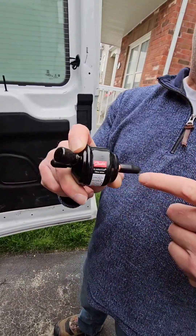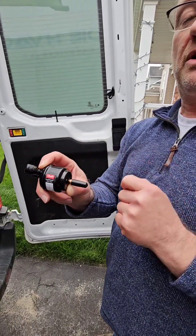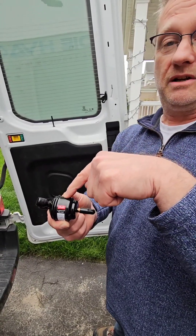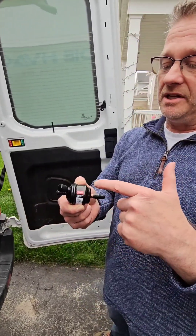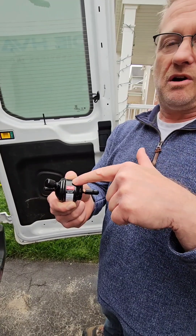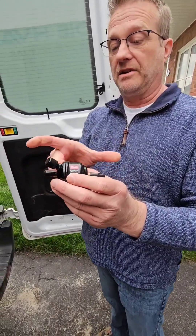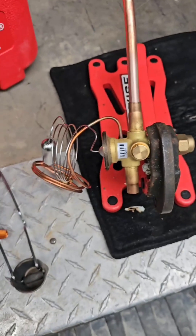This dryer has an access port and a cap tube connection — you can cut the cap tube off if you don't need it. We originally came up with this design for manufacturers of merchandisers using R-290. If you use a standard three cubic inch dryer, your refrigerant is sitting in the dryer instead of doing work in the evaporator and condenser. So we developed this solid-core dryer to replace loose-bead pencil dryers, and added an access port. I use a wet rag for protection when brazing.